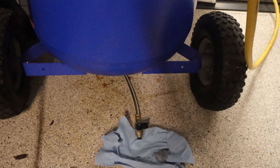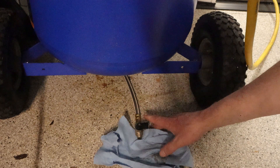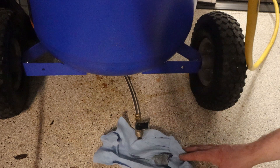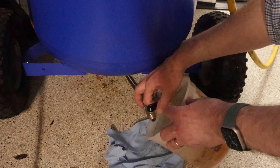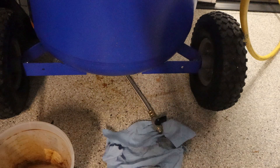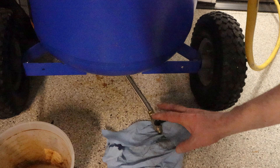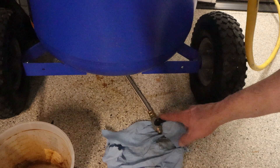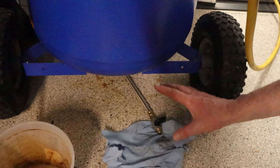Before I got my 30-gallon vertical compressor, one of the things that I always hated was emptying the water from the compressor. This is under full pressure right now, and this is an extension that I got from Lowe's at the same time that I bought this compressor. I can just take a bucket and open it a little bit, and you can see the water comes out. It's pretty dry right now, so there's not a lot of water, but that means I can empty this frequently and it's really easy. I'll put a link to this below — I love having this.